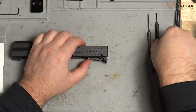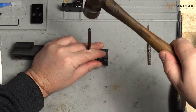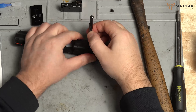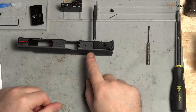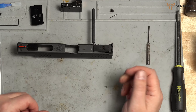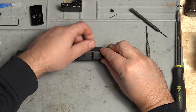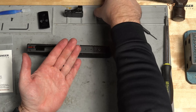Now the next part is a little tricky. We want to just set it on its side and take the 1/16th inch roll punch. Now that we have it removed, we're going to put the pin up here. Notice I left the pin in here — there's a spring with a retainer in there we don't want to lose. If you're not sure on your spring-catching capabilities, just put it in a plastic bag and pull it off. We'll pull it out and gently bring it out — here's the retainer and the spring.